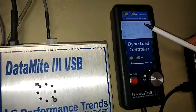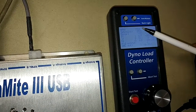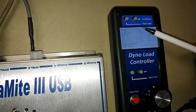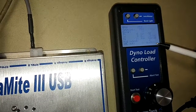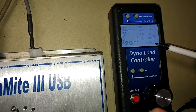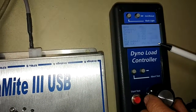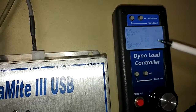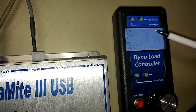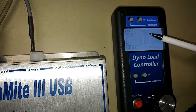What you can see here is our set point — the desired RPM — and our actual RPM. They're very close, and to hold them close we're putting about a tenth of a volt here. If I dial the set point down, watch what happens: the voltage goes up to put more brake on it, to bring the actual RPM more in line with the set point RPM.